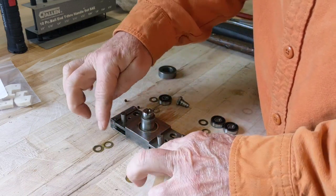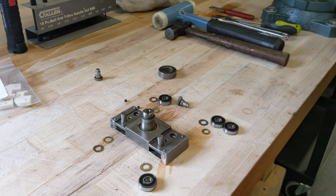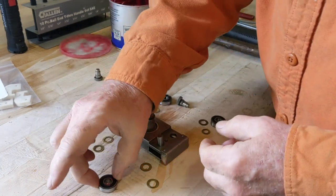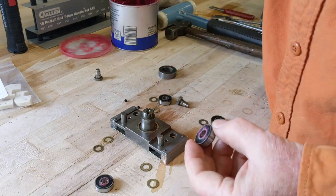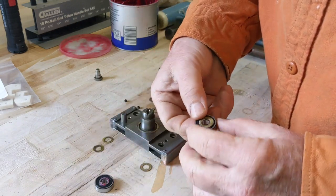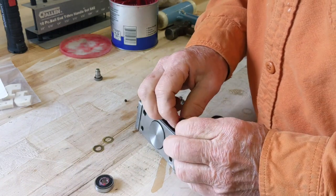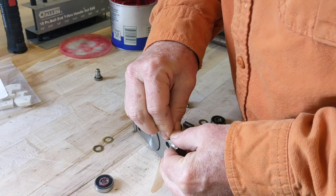I'm going to get a little bit of grease so I can get these stuck in place, which will make assembly a little bit easier. By the way, these are the new bearings I bought to replace the frozen original bearings — not all of them were frozen, but a bunch of them were. So we're going to need one of these on the bottom and one on the top, and then we'll get them in there. Part of the issue is I have to push these bearings up against the bearing wiper.